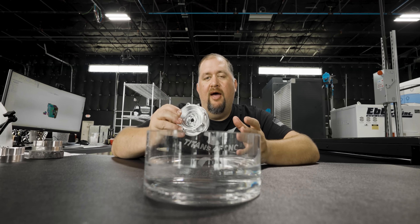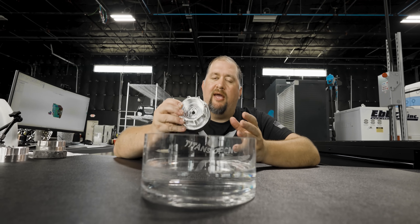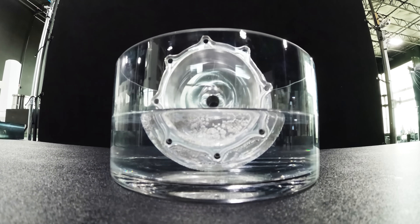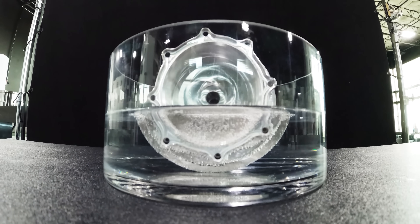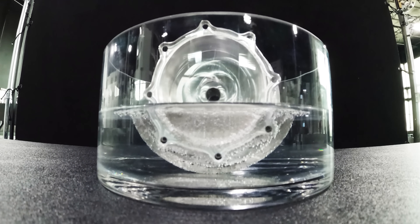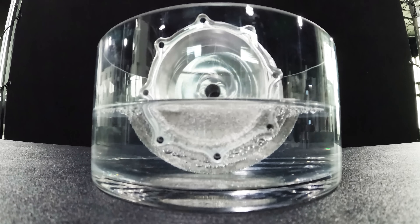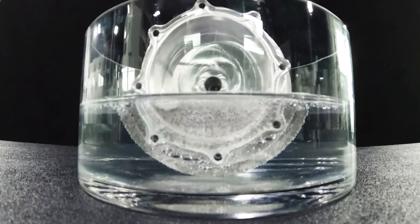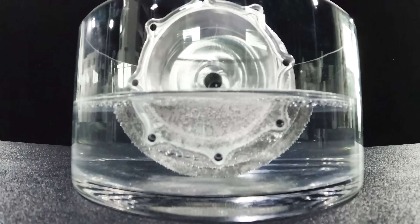Now that we're done with op 1, I'm going to show you guys why we don't put magnesium in water or in water-based coolant. We have just a bowl of tap water and we're going to sit our part in it for a few hours and see what happens. What we should end up seeing is corrosion forming on the clean metal and bubbles forming, which is hydrogen separating from the magnesium.